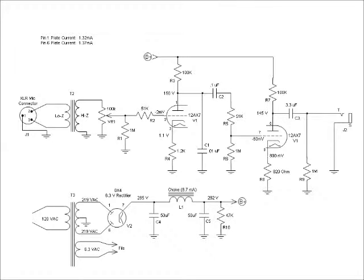I've connected a microphone to it, and once the project is finalized I'll do a rundown using a microphone so you can hear what it sounds like through an amplified system. There are still some modifications I might make — I'm not sure if I want to add cathode bypass capacitors on the primary stage to increase the gain a bit more. I also need to connect that ground on the power supply and finish a few other things. Once it's done I'll post a complete rundown, but I hope you enjoyed this.